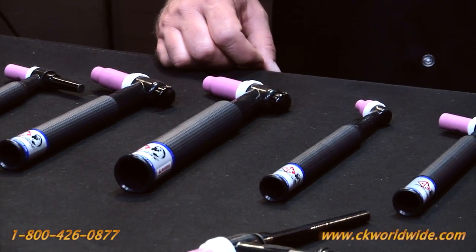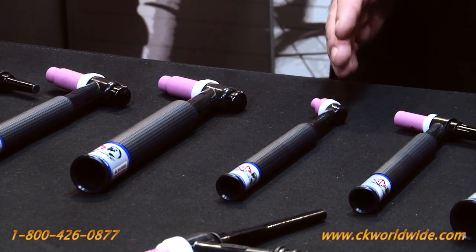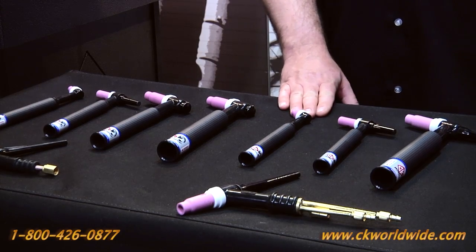Here we have the 26, rated at 200 amps at 100% duty cycle. Then you can see the torch head gets smaller again — we go back to the 8 series head from the 80 amp gas-cooled torch, only now we've incorporated water cooling. That water cooling allows it to dissipate more heat and carry more current, so this torch is effectively known in the industry as the 24W, rated at 180 amps at 100% duty cycle.